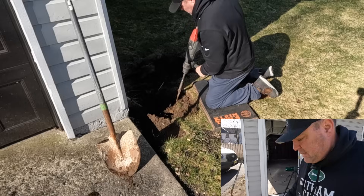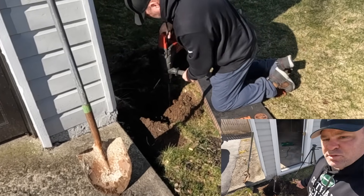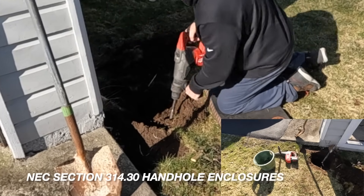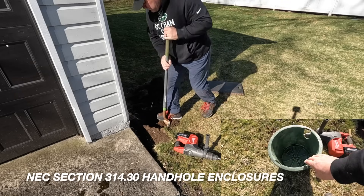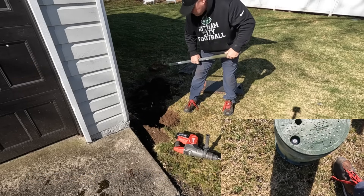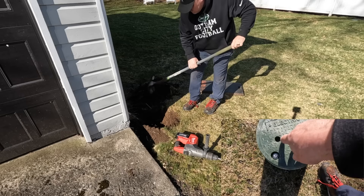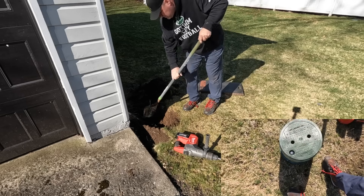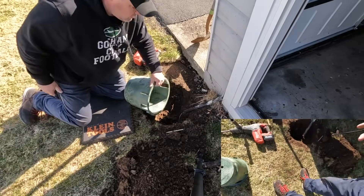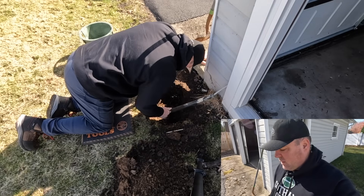What I'm doing here is adding an in-ground junction box called a hand hole. You can't just bury junction boxes in the earth, but here we're using a hand hole. This side is marked 'electric' and this screw right here keeps it physically attached so it doesn't come down. These openings are just so you can open up the box. Once we set it inside this hole, we will backfill it — even on the inside — with pea gravel, so should water get in there, it'll be able to drain back into the earth.